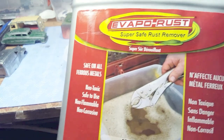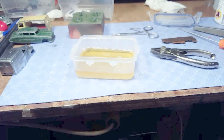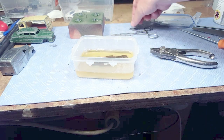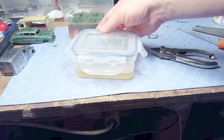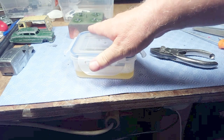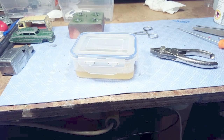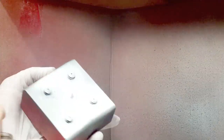The base is still rusty so I'm going to put it into some Evapo-Rust. This stuff is amazing — it takes off the rust but it's not corrosive, doesn't harm you, you can put your hands in it. It takes a long time so I usually leave it overnight. Next day all the rust will be dissolved. Now for a little primer on the hubs — I'm doing one side, then I'll flip them and do the other side.